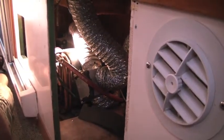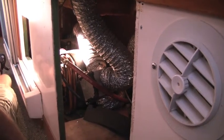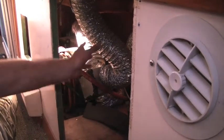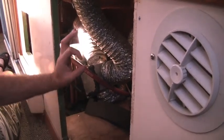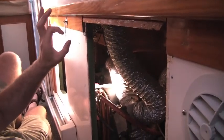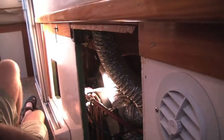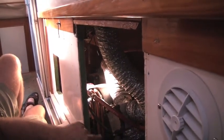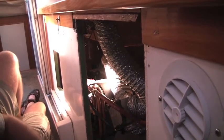It's always been the way it's been done, but it's very inefficient. If you can mount separate evaporators scattered around the boat where you want the cooling, instead of running a large duct, we're running two small hoses and a wire bundle — something that takes up much less space. It's much more effective to transfer the refrigerant to where we need it, as opposed to trying to transfer the air. The refrigerant doesn't pick up heat on the way.